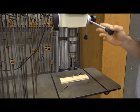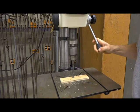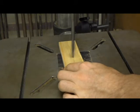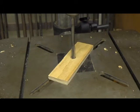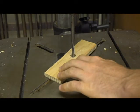When drilling down, you are placing force on your project, and it does not have freedom to spin. It is only when you let off the drilling pressure that your project can become free to travel. It is at this point that students relax because they have drilled through the project, but as the bit comes back up through the material, it causes the extra freedom and movement to bind awkwardly in the hole, and your project will turn into a lethal object.